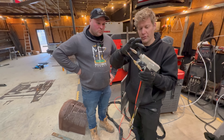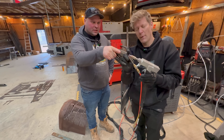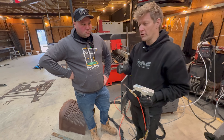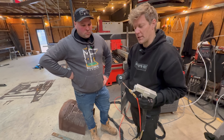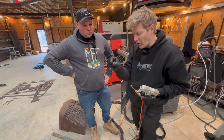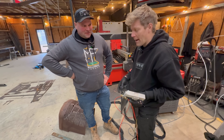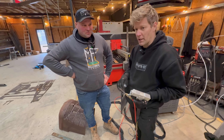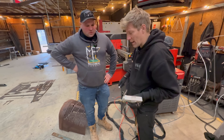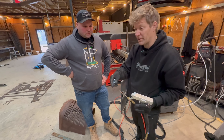When you're welding you put the little nozzle on the end and the wire feed comes out near it - the laser melts the wire and melts the metal. It makes a really neat job but it's a bit weird if you're used to other welding because you can't see any penetration. It's just a really bright light and then it's done. The bloke who brought it out said people who can't weld actually find it easier than people who can - you just literally move it across.